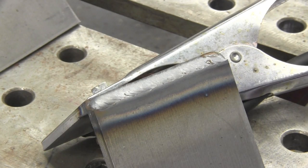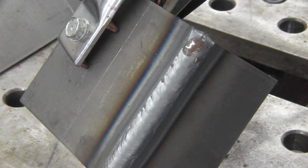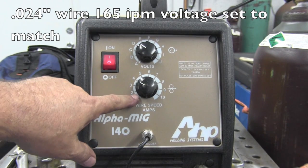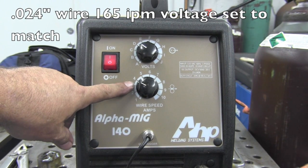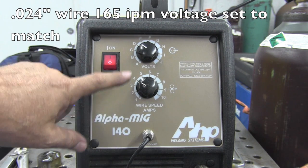And you can see that's nicer — that's hotter, getting down into that bottom like it should be. I'm pulling this; you could push it or pull it. It's a good hot machine; I've still got a lot to go on the voltage, so if I went up to .035 wire I could go a lot hotter even on this little 115-volt MIG. Alright, let's swap over now to the AHP Alpha MIG 140, using .024 wire here — have to set the wire feed speed higher, 165 inches a minute. Smaller wire, so it needs more of it. We'll start again using the thin stuff, the 18 gauge.